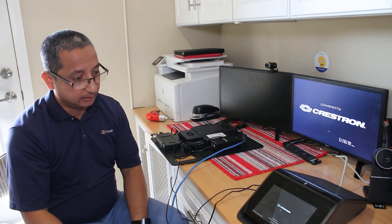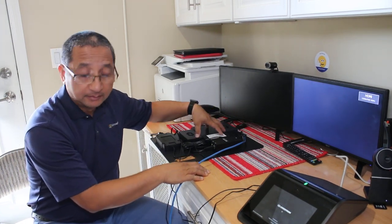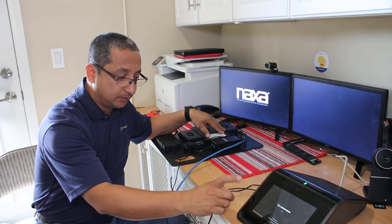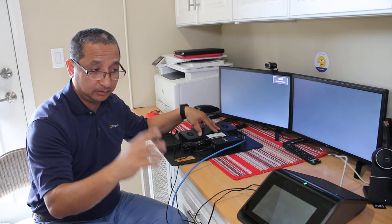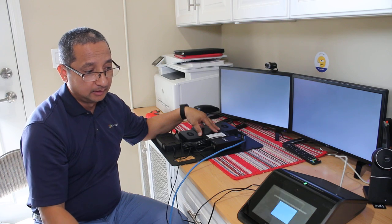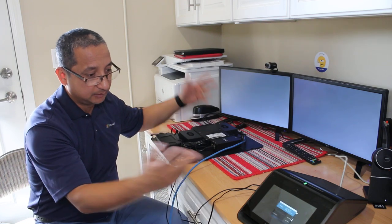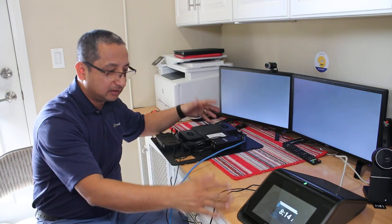You need to connect from the Mercury console to the NUC. What I did is take the MAC address of both devices and in my DHCP server I statically assigned IP addresses so they don't change. Every time this boots up it gets the same IP address. This is highly recommended - otherwise the UC engine could get a different IP and fail to connect.